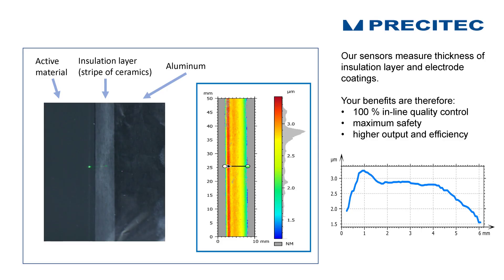But what is this type of ceramics good for? In general, there is a separator between cathode and anode. This separator might be made of polypropylene (PP). However, this material deteriorates at temperatures above 110 degrees C. In order to increase thermal stability, some layers of ceramics such as aluminum oxide are deposited on both sides of the separator.